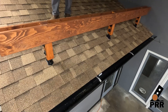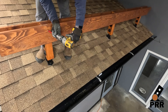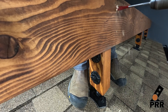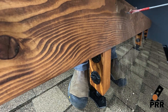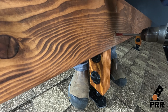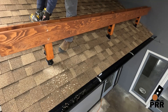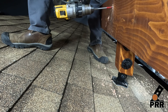With both of our beams in place, we can now drill the holes for the through bolts using a nine-sixteenths inch drill bit. These holes are placed in the center of the posts and one and three quarters inch from the top and bottom of the beam. To ensure straight holes, drill halfway through one side and finish drilling the hole from the other side.